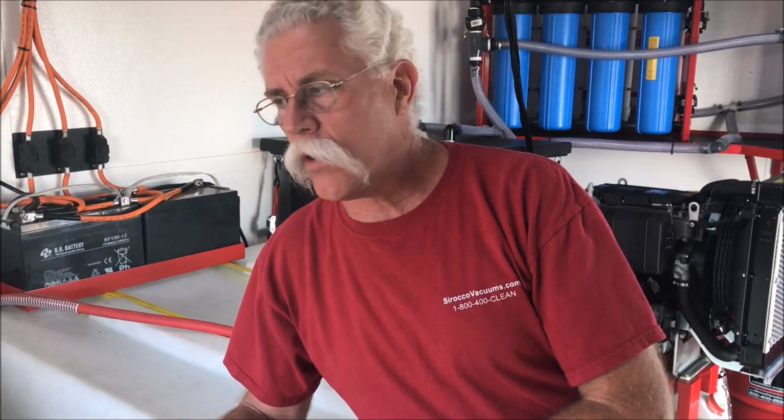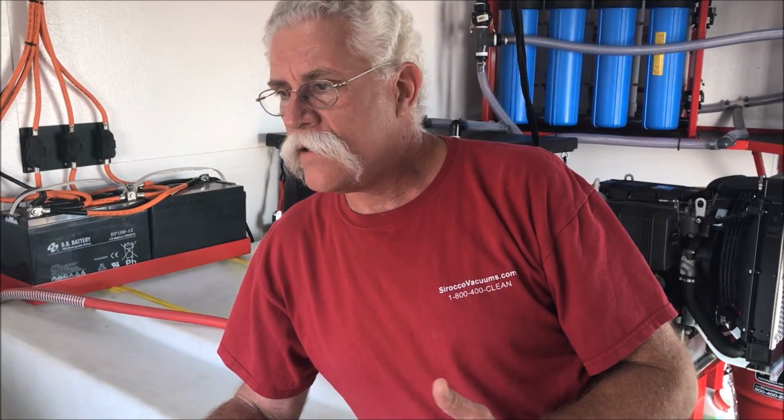And by the way, if you've only got an 8-gallon-a-minute water supply, you only have to turn the engine speed up halfway, and the two pumps are running at a total of 7 gallons a minute. You can run that to one of the heaters and still have your full temperature through one heater without overheating the water in two heaters. There's lots of ways that you can use variable engine control, multiple heaters, and multifunctionality, so that you've got all these options.